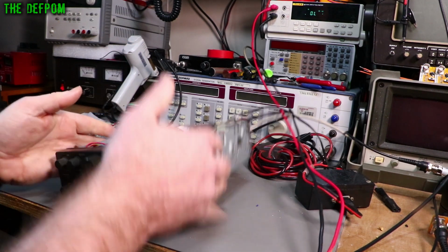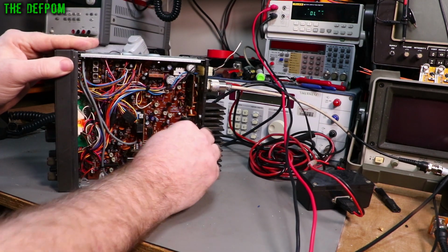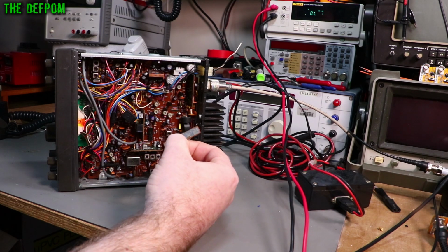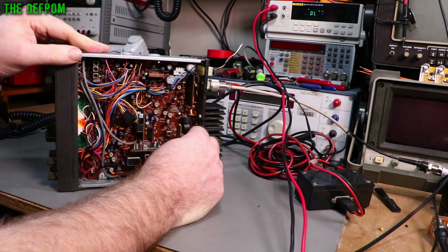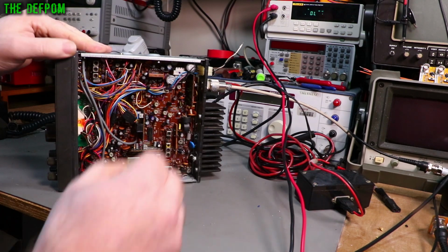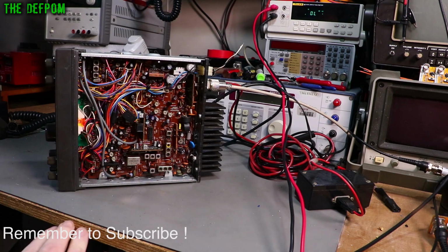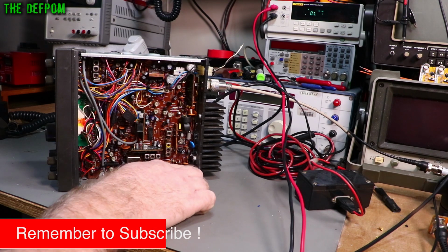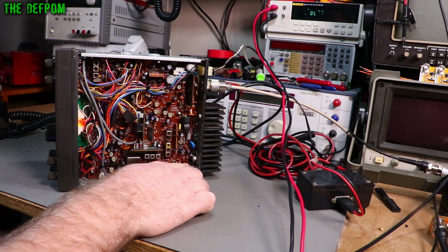How I tracked that back was, you've got this jumper link in here. Let's pull this out. You normally take this out when you're doing calibration stuff. You check the currents on each one, and you tune those to be like 50 milliamps or something. I pulled it out and I was measuring the bias level on the driver over here with the oscilloscope, which is running right now. You can actually measure it on that inductor there. It's a ferrite bead with a wire through it.